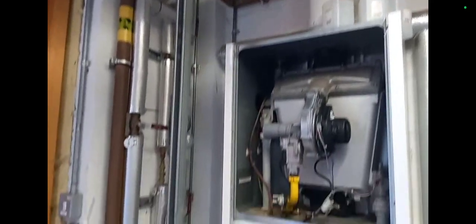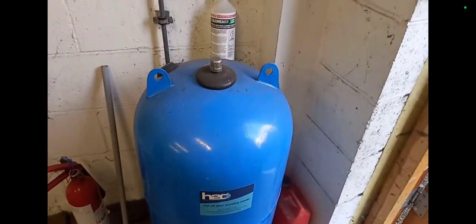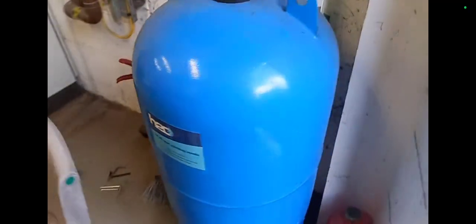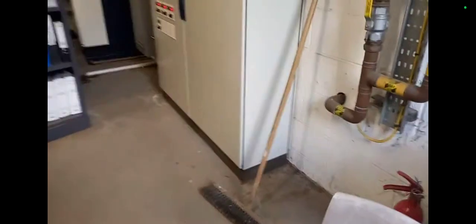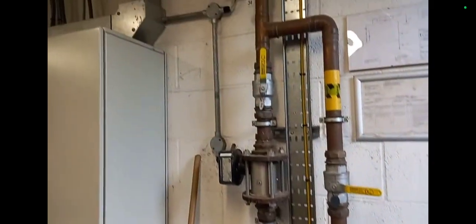So tracing the gas pipe. I'm currently filling the system up because when I got here the pressure was low. I have to be careful because I'm not sure if there was a leak on site, so I don't want water to be spewing out at a different part of the building without me being aware. Site haven't told me anything about there being a leak as yet but I'm going to ask them later.